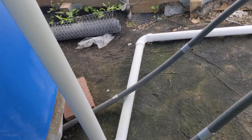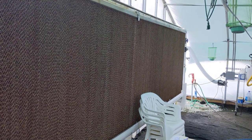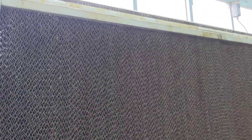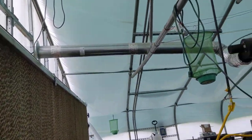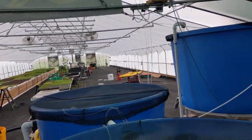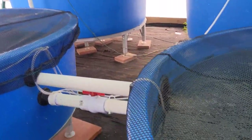We have a little optional out-valve here so we can irrigate things on the outside — it has pretty good pressure when we tap into that. This is our 25-foot wide by five-foot tall evaporative cooler water wall. This thing is magic in our climate — eastern Colorado is dry, dry, dry — and it's very effective at changing the temperature of the incoming air as it draws everything into those 48-inch fans on the far side.